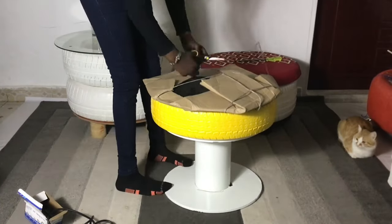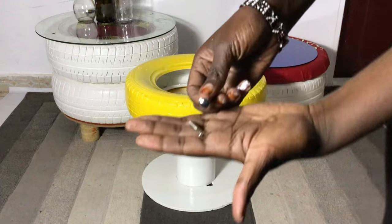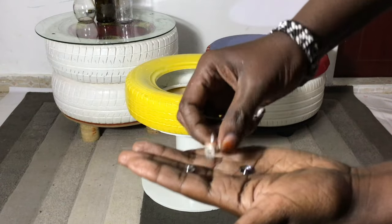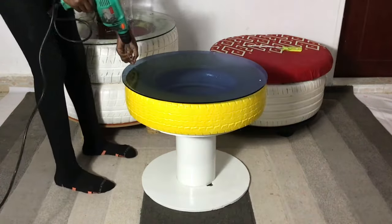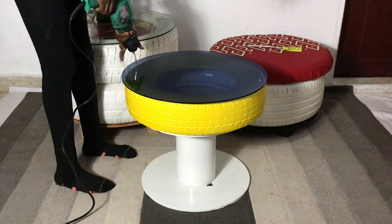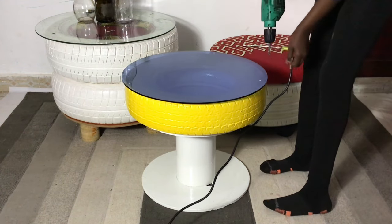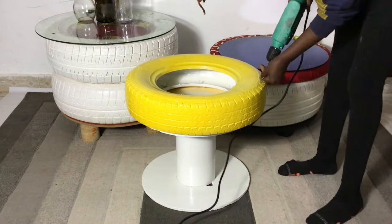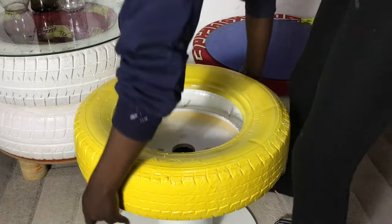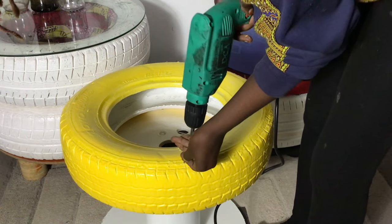Now we're going to put the glass on top. Before you put the glass on top, make sure you clean it up. Those are the screws I use — they are called glass screws. When you're buying the glass, just remember to buy the glass screws. They have a head which gives your work a nice finishing. I push the screw in just a few inches, then remove the glass and use the MDF screw to create a hole — I do not push it all the way because I do not want the hole to be too wide for the glass screw. I'm just creating holes right now.